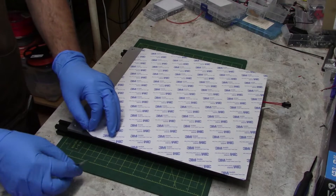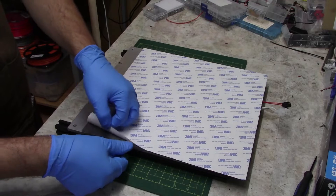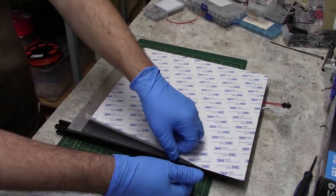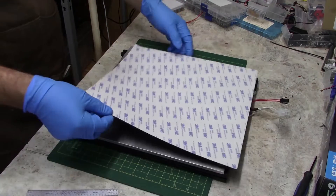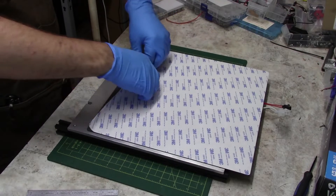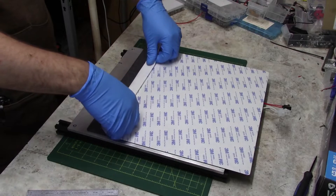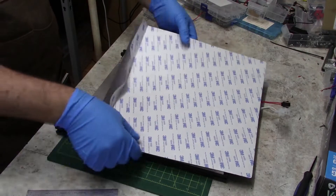The reason for this is that while size-for-size does work, when you have an oversized magnet this allows for some forgiveness when it comes to aligning the magnet on the bed, as you can trim off any excess. If you order a size-for-size magnet for your bed, you just have to take more time when installing and aligning your magnet to ensure that it is seated evenly on the bed itself.